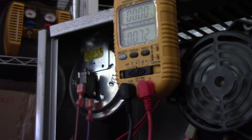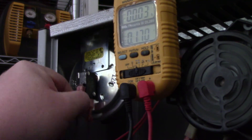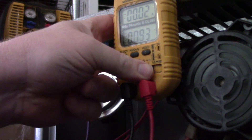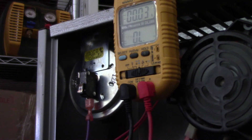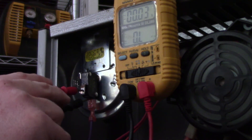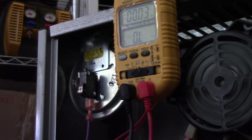Let me give a call for heat here. With the hose disconnected, it's going to say 'pressure switch stuck open.' Anytime you ohm out a component, you must isolate the component — you cannot leave both wires connected and have it ohmed out. We're going to take the meter, put it to ohms, touch the leads together to verify the meter works. We'll put one probe on the metal tab, one probe right there, and lo and behold, it reads OL on the meter, which means that pressure switch is open.